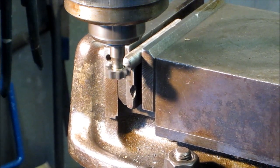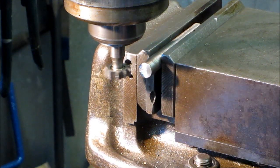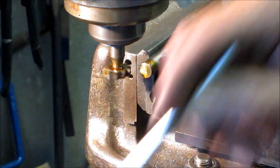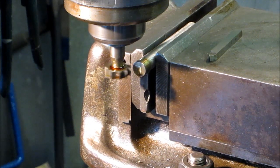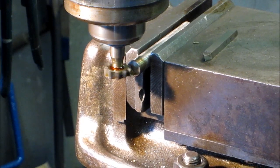Now what we're going to do — we've got that piece of cold roll, half-inch, and we set up our Woodruff key cutter, a quarter inch, and we're going to make a quarter-inch form tool on here. We're going to broach that with this tool, but we need to go ahead and put a slot in it, and we're going to silver solder the tool bit right in there.